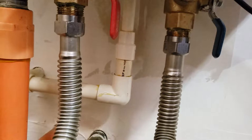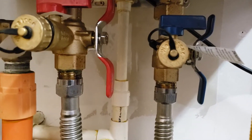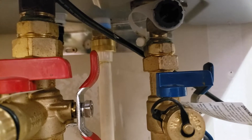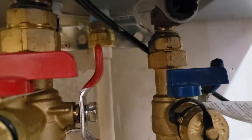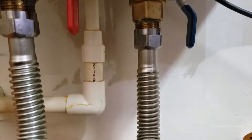We just went over to the Ace Hardware store and they had all the CPVC fittings we needed. Right up top is a union — like a hose fitting on one side and then a half inch female thread on the other, so it threads right back onto the Rinnai. You can see the blue Teflon tape back there. And then a gasketed hose union down to the half inch CPVC, and then a three-quarter by half reducer tied straight back in.